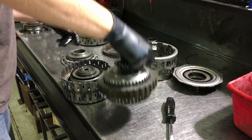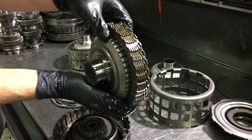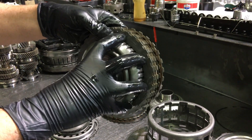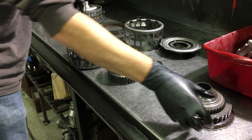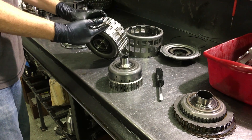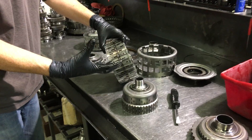We'll move the baskets out. Here are the plates for the A side — 2-4-6 — on this basket. As pressure is applied, adding more and more pressure is going to allow the whole assembly to rotate. That's it for the 2-4-6 side. It's pretty ingenious to have a seal on one side and transfer all of that pressure over to the other end like that — that's how they can make this so compact.